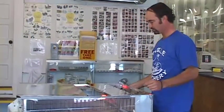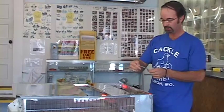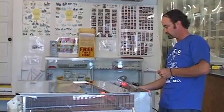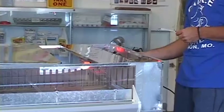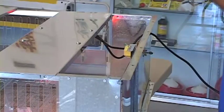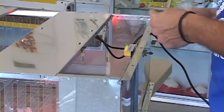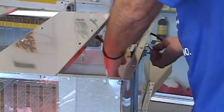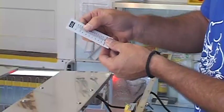We've done a test — let the unit heat up for about 15 to 20 minutes, and right now it looks like it's at about 90 degrees. So I'm going to loosen the wing nut and turn it counter-clockwise to increase the temperature. I've turned the wafer two times and then tightened the wing nut to lock it in place, so it's going to heat up a little bit more. We're going to wait another 15 to 20 minutes and see if we can get the temperature up to 100, and also make sure that the floor temperature is up to 100.